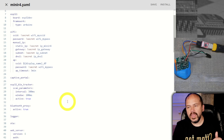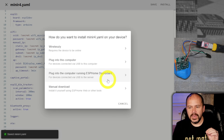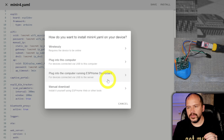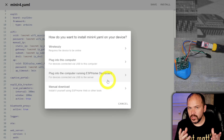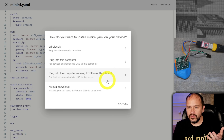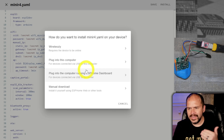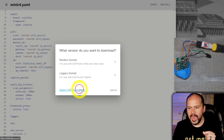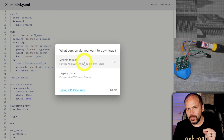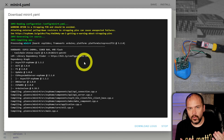I'm using the BLE tracker and Bluetooth proxy on this one. Hit install — you do need that factory bin file. If you have your setup where you can just plug into your Home Assistant box or wherever you have ESPHome running, great. Otherwise, for the initial flash of ESPHome on ESP32, hit Manual Download and choose Modern Format — that's very important. It'll build and download that bin file straight to your computer.